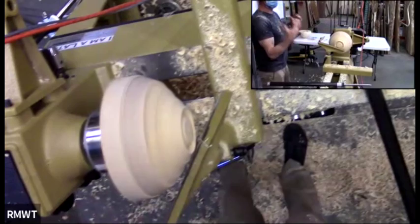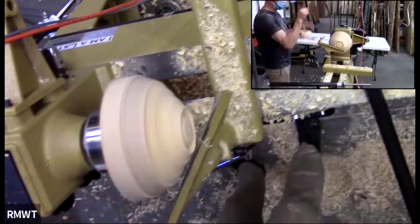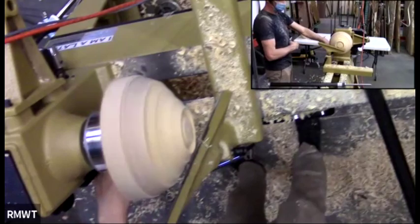But nobody ever cleans this enough that they didn't pull it once and pull it back. You get a tiny bit of dust, that's enough. You can't make dust to zero by crushing it with that wrench. You don't have enough leverage. And so it just rocks a tiny bit. And that's what you're listening to here.